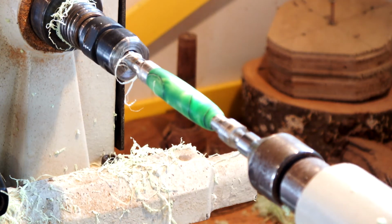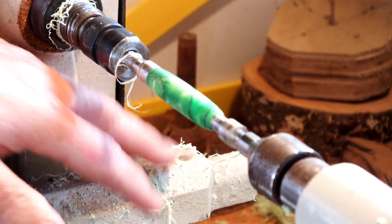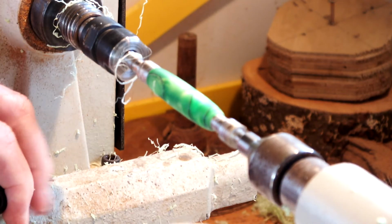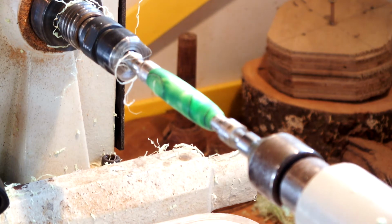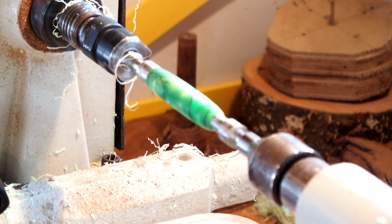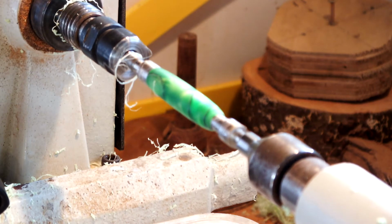Now with some people, they like to wet polish. Some like to dry polish, but with micro mesh and the amount of friction that's generated, my personal preference, and it's only mine I should stress, is just make everything wet, keep a bit of cooling and lubrication on there. It's easier to clean the swarf that you generate when you're doing your sanding off. Clean up afterwards with water as well, or not as the case may be. I've been very naughty and haven't done so this time.